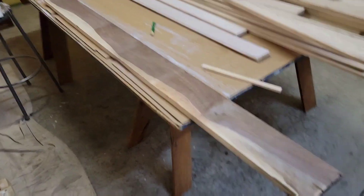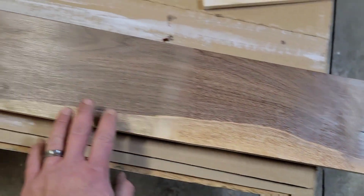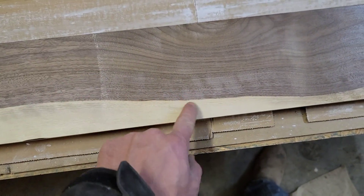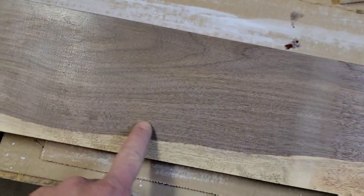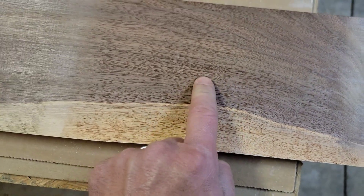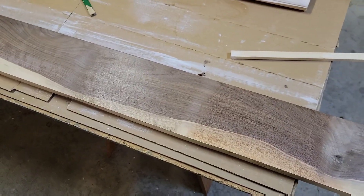I came back in the garage here to look at my board and it's changed a lot. This was my one stain, this is another one, and then this is the clear — and the clear looks really splotchy, like it's soaked in or something. It just needs another coat, which we're going to give it. But you can clearly see the strip between where I put the two different stains, so the stains definitely did something. This one didn't change the dark walnut very much — it does have some darkness in the sapwood, but this one really kind of brought out some of that. I like that. I don't think my wife will like it, but I really like that. Now this I don't care for as much. I'm going to throw another coat of the finish on there and then we'll come back in the morning and see what it looks like.